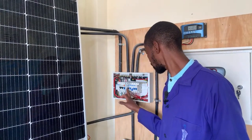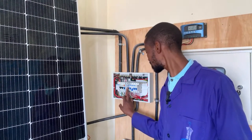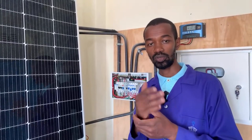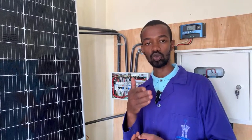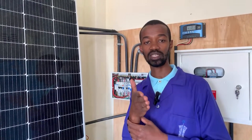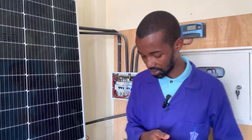We normally start with the circuit breaker which is rated high amps or high current. For instance, if in a home you have the cooker circuit, you'll have it connected to a 32 ampere MCB. When we are talking about a socket, we'll have a kitchen socket dedicated to a 32 ampere MCB. A socket in the bedroom or sitting room, which does not have high-powered appliances connected, can be dedicated to a 20 ampere MCB.